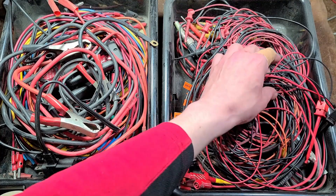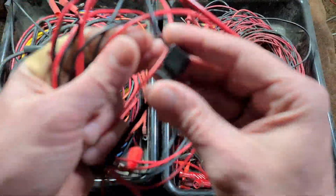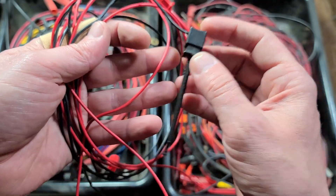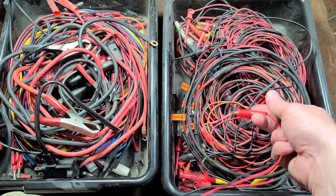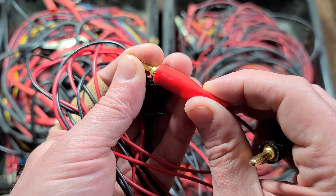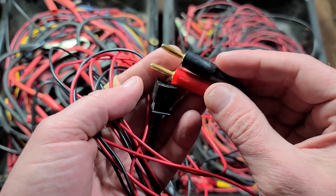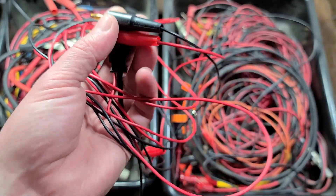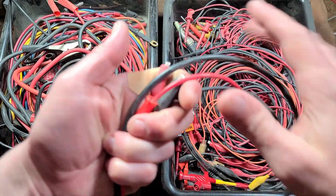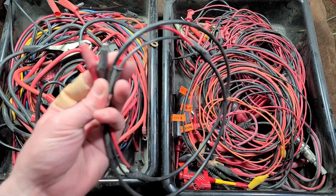You can also make basic custom ones. Companies like Mueller Electronics sell these spring-loaded hooks that you just solder your own wire into. I did that and just used some audio gold-plated banana plugs. Mueller had these little insulated boots that were banana plug-sized, which was kind of odd but convenient. I put these together because sometimes it's just convenient for both testing or powering objects to have some custom ones. This is just what a commercial-grade version of the same item would look like.